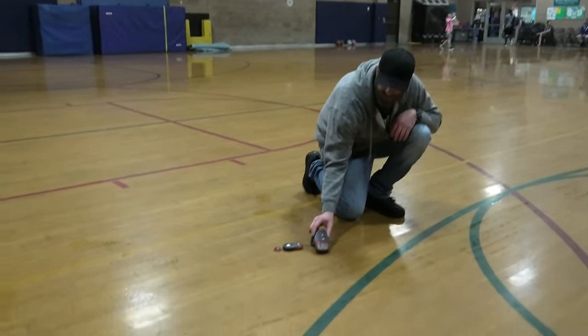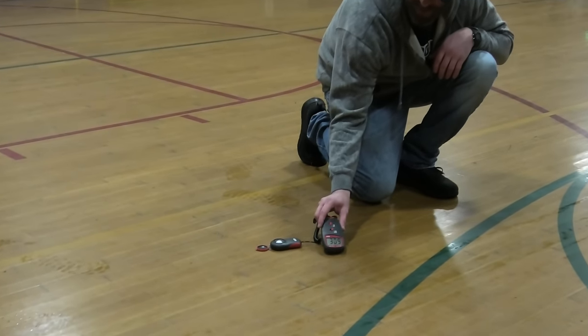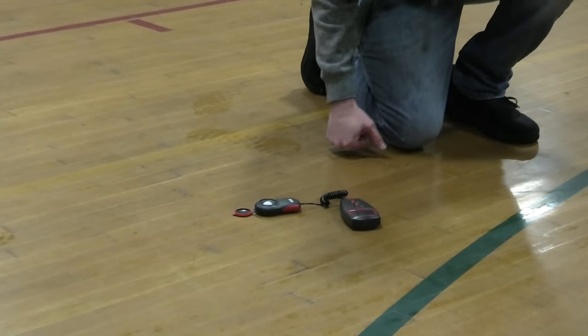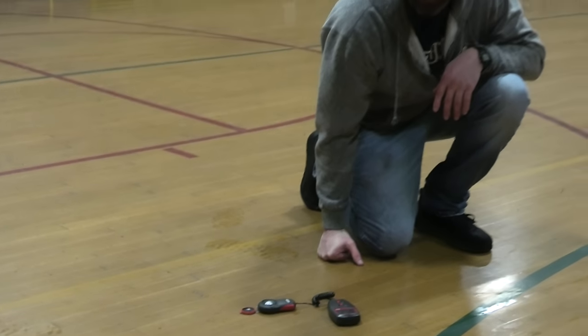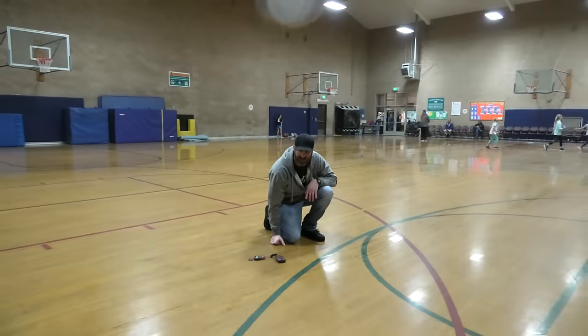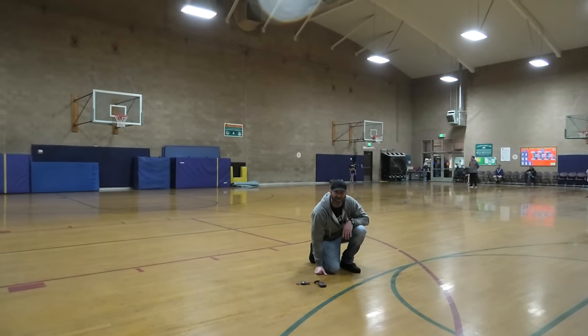You can see just about 31 foot candles on the meter — my shadow may be affecting it slightly. Pretty good lighting all around, and once again you're not seeing much shadowing because of the good crossover lighting. That's always something to keep in mind when you're doing any kind of lighting, especially for sports.